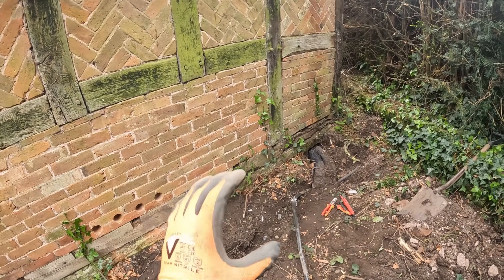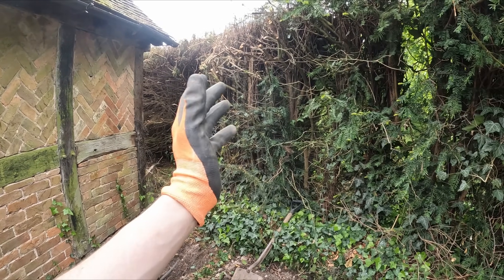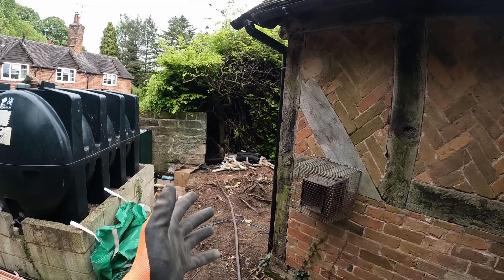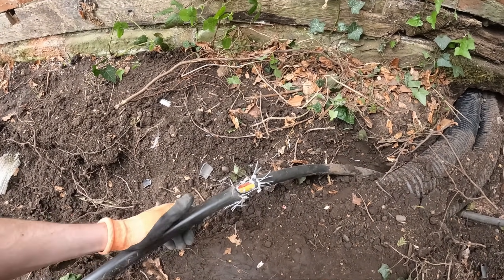We've progressed — confirmed it was dead visually and by testing. But with armoured cables like this, you've got a 50-to-200-metre run that way and another 50-to-200-metre run the other way. You physically can't follow it underground. I've locked it off, isolated it, tested up that side — it was dead. But to double- and triple-check before I go and cut through this with a grinder and potentially go bang, I've done something a little different. It doesn't look pretty but it's for my safety, and I'm newer to working with cables like this — why not spend five to ten minutes saving my life?